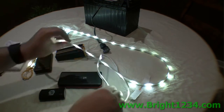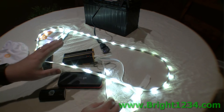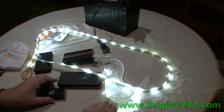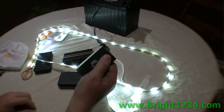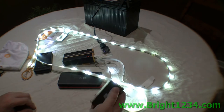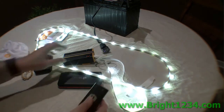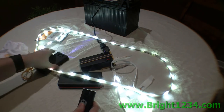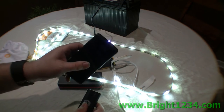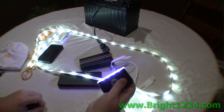Both Luminoodles are running at the same time off the Pronto 12. It was really wrapped up tight and took me 30 seconds to unwrap, which is not great on camera. One Luminoodle is two and a half watts; two running is only five watts. So one Luminoodle on the 4400 will run for six hours, and one Luminoodle on the Lime Fuel battery will run for about 30 hours.